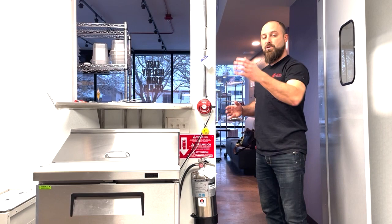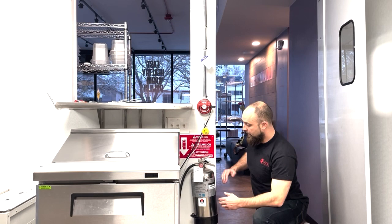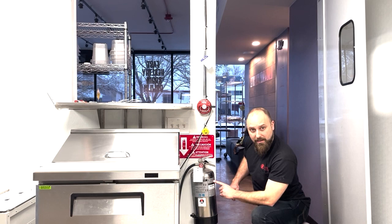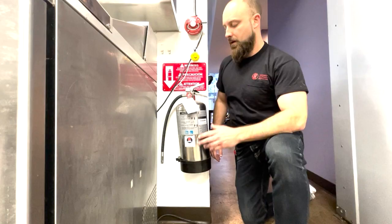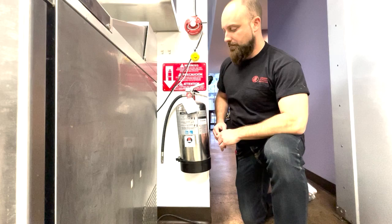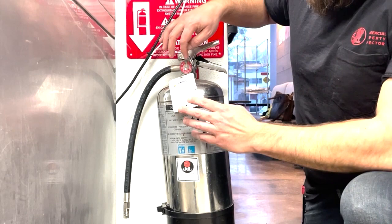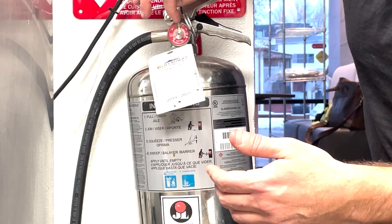The second component mounted here near the egress path, by the doorway back into the dining area, is this portable fire extinguisher. You want to verify that it's Type K, which would be noted on the label, and that it's serviced regularly. It must be mounted and easily accessible — it couldn't be blocked by a cooler or have storage around it. Just above the service tag is the pressure gauge. A properly pressurized fire extinguisher will have a needle that's in the green. That's an easy check you can do for any fire extinguisher installed in a commercial property.